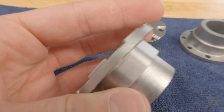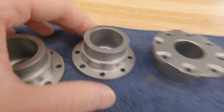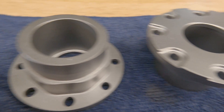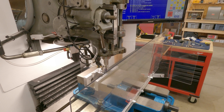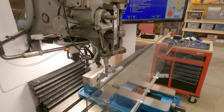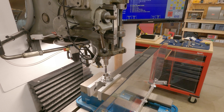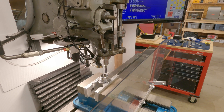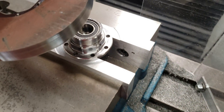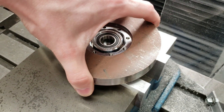And now they're back. These were quenched and tempered at Winston Heat Treat and bead blasted as well, hence the surface finish. In order to hard mill this part, I whipped up a quick set of soft jaws and started cutting. The feeds and speeds for this part were nearly identical to those used on the AR450. I machined all surfaces down to within 2 thou of their finished dimensions, measured them, and then crept up on the final size, test fitting the bearings and disc as I went. In the end, the bearings required a very light press fit with the arbor press, and the disc fits on nice and snug.